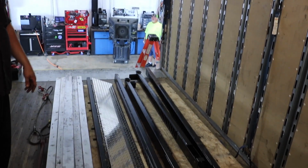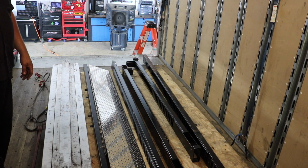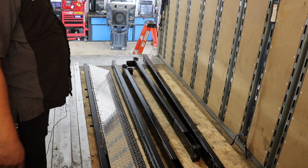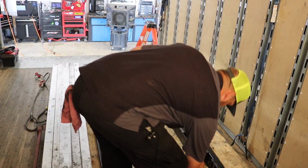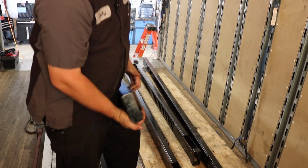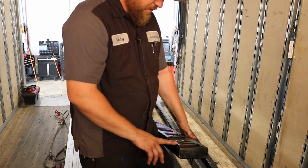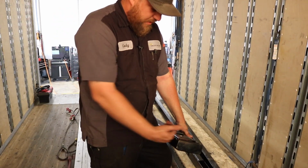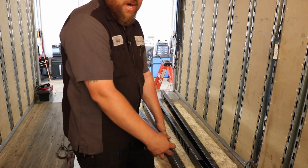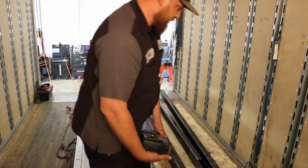Next, you'll want to locate your roadside or curbside beam. The first plate we put in was number 1, second plate was number 2, so we'll find number 3, which will be your curbside beam. It's important that you get these correctly. The E-track is welded all the way up to the top on these, and you'll have a larger space on the bottom. This is so that your deck will remain flush once it's assembled.